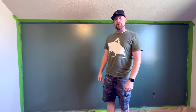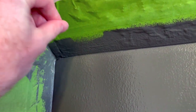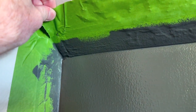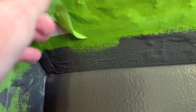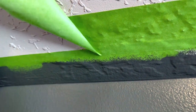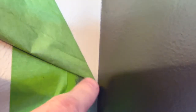I'd say that looks pretty good - what do you guys think? Leave me a comment. I let it dry overnight and it looks great. Now it's time to take the tape off. When it comes to taking the tape off, you don't want to pull it straight off the wall. Instead you want to pull it at a nice angled edge so you're not pulling the paint straight off the wall - that'll help you not have any issues with the paint pulling off. We've got these nice clean lines and we don't have any bleeding because of the tape technique we used.